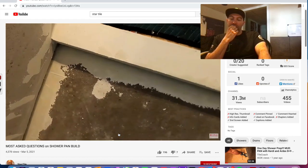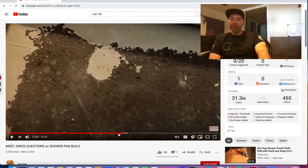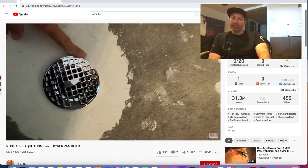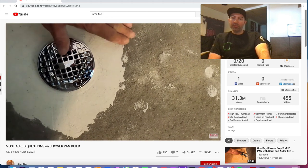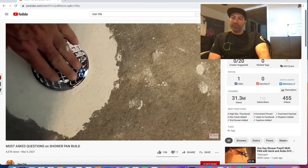Well, the whole shower gets waterproofed, including the curb. And I put... Yeah, and again, doing liquid on top of a traditional pan liner is completely wrong. You're gonna have a mold sandwich. Do not do it like this, folks. Please. And then tomorrow I'll do a white bead of silicone all the way around here, so that definitively, and then the RedGuard will overlap on the silicone, definitively no water will get in.